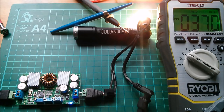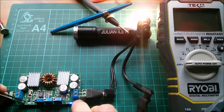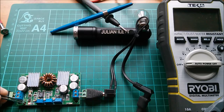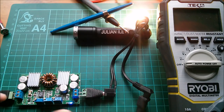I can test this even without putting a switch in there, because I think if I've checked this correctly, this end pin goes off somewhere and the middle one is connected to ground. So if I short those together, I should be able to implement this on/off facility. Let's do that with some tweezers. We don't need that on anymore - let's just short these two pins together. The little red fault light comes on, the bulb goes off, and the output LED goes off when I've shorted these two pins.